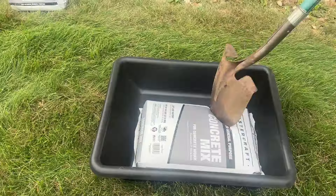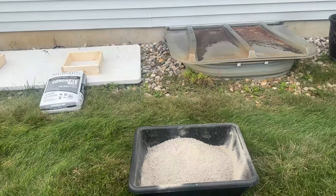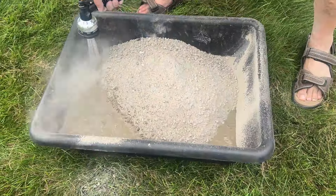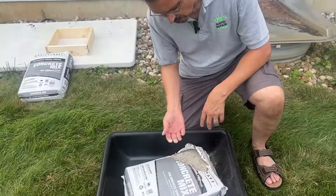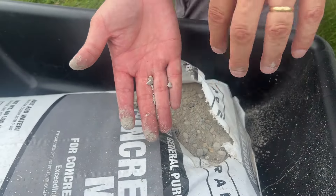Let's get to mixing the traditional wet pour first. Concrete can be a bit corrosive, so you really should wear gloves for best practice. Now when somebody says they're mixing cement, they're actually misspeaking. Concrete is the total of the cake, the total of the recipe. Concrete is made of portland cement, sand, aggregate, and water. Aggregate is simply small stones — it can be sand, but typically it's going to be small stones. That's your aggregate.